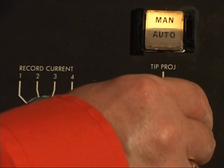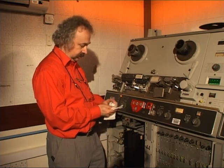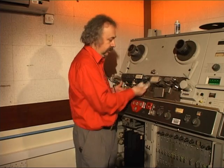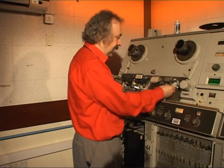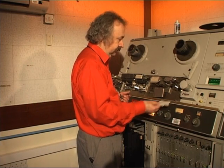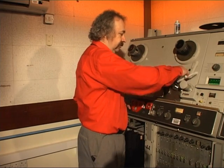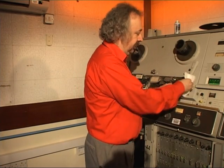There is a control to move the guide in and out, and there is also an automatic servo to do that. The audio heads have to be cleaned as well, and also the monitor stack that goes on the back of the tape. The capstan is cleaned - on this machine we can spin it up to speed and carefully clean it. Finally the last guide, and if the timer wheel is metal we can clean that as well.